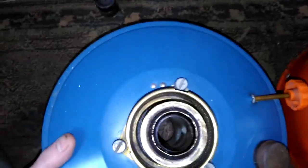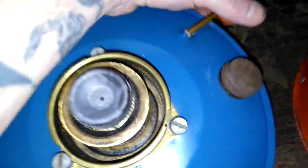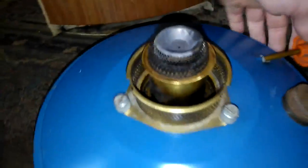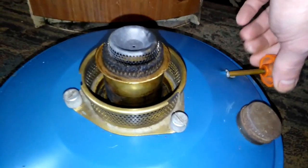You can tell a blue flame because you take the flame spreader out, and there's a hole straight through the middle of the reservoir, goes all the way down. You can see through. And that is to let air reach the inside of the cylindrical wick to get more premix, a better mixture. This burner, see, there's plenty of holes all the way around for the air.